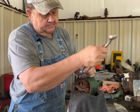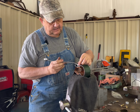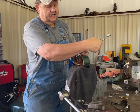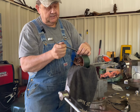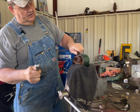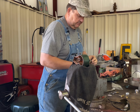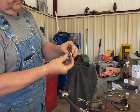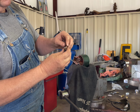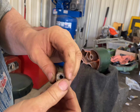I'm going to attempt to bead blast the inside of this mixer while trying to save as much of the paint on the outside. We don't really want to do any more touch up to the engine as it already is. It's an older restoration, but so you can see that the pot metal is fused pretty well in to the nut.